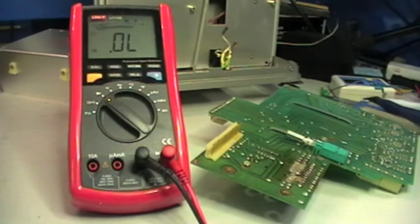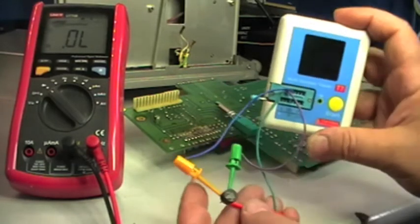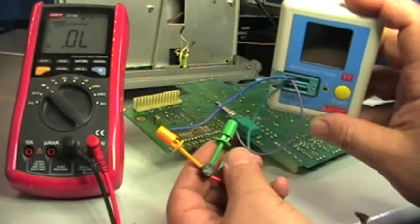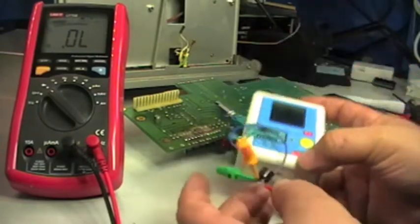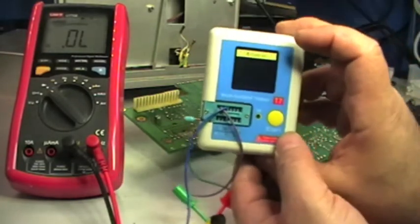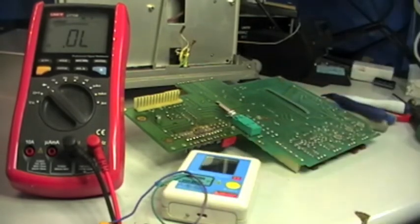Let's see if I have in my hand that, and if they are original. And indeed, what I've seen on circuit, I'm seeing also outside. So it's connected to both AC input and to negative side of the bridge rectifier. So here it gives me two diodes. That's correct. So if I move on the positive side, it's giving me only one diode. So for sure here we have a missing diode, and this can cause, of course, a high ripple.